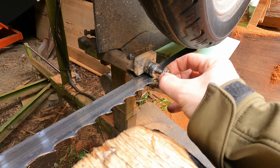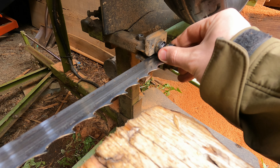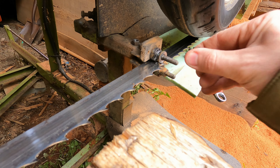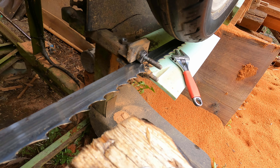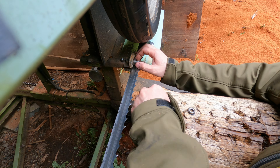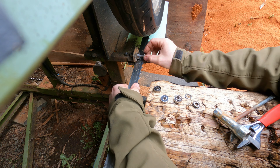Pretty typical — I forgot last time I ran this mill my top guide bearings had blown out. These are the guide bearings that get all the sawdust and debris on them. Of course, I buy them in like 20 packs — they're just basically skateboard bearings, I think they're 608s. So I put some new bearings on here and freshen this thing up.